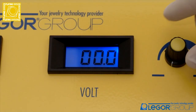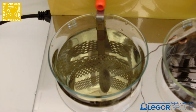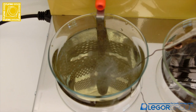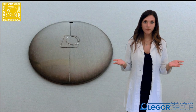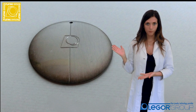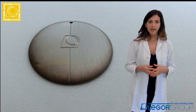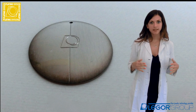It's important to avoid hydrogen bubbles when palladium plating, because when hydrogen gas comes in contact with palladium, it makes it darker and less shiny. Pay attention that if you apply high voltage on your rectifier or plating machine, you'll face this type of problem — an excessive burning — and this problem will be more evident in high current density areas.